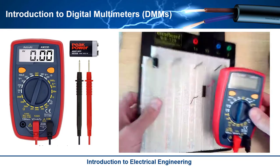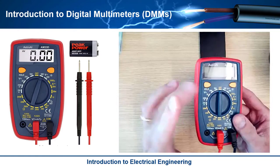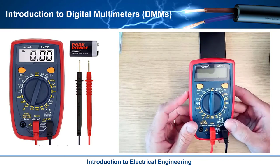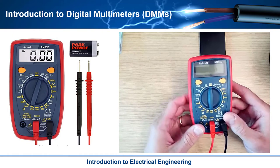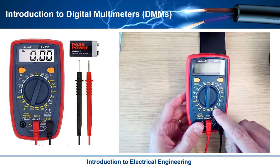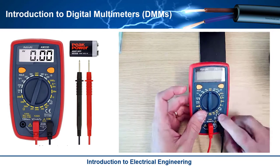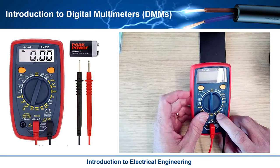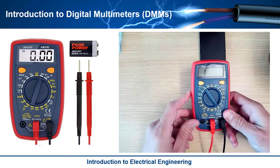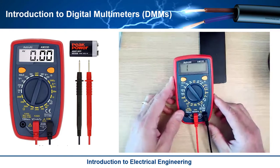Here's how you use them. First and foremost, you have to decide what you want to measure. Let's start with something very simple, which is going to be continuity — that refers to whether or not there's an electrical connection between two points. You're always going to see this symbol down here, a little pattern that looks like beeping. That's going to be your continuity, and it's also always with the little diode symbol — the triangle with a line on it. To put it in that mode you simply switch this over, now it's in continuity mode and the display comes on.